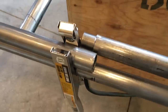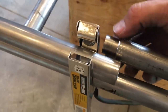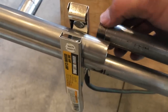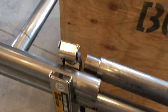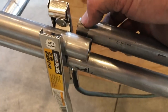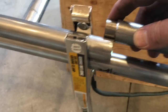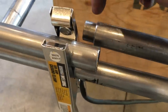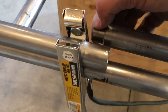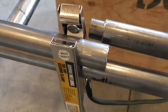I just barely tacked this top piece - I had a piece of angle iron clamped on there to make sure it's straight. To butt these two pieces together, since the metal is so thin, I've been putting a little insert piece inside the pipe. You just find something with a similar outer diameter to match the inner diameter of the tube. I made little plugs about three inches long, put the two pieces together, leave a little gap so your welding tacks onto all three objects - both sides of the tube and the insert.